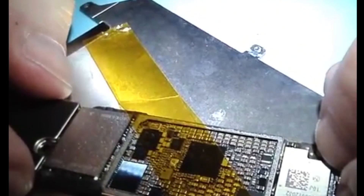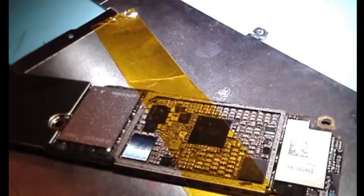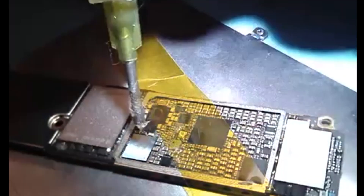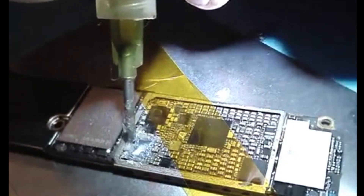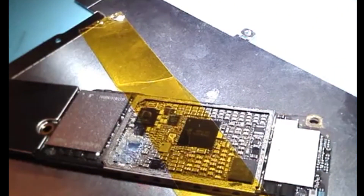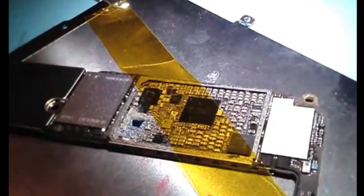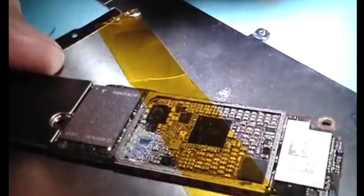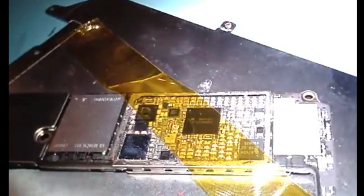So we're going to tape that down and then start on the repair. Now that this board is where we want it, we're going to crank up the hot air gun to 350 with a mild medium airflow. You want to come in and out on this board very quickly, because you don't want the Qualcomm or the cellular service to pop off the other side. So what I'm doing now is adding a little bit of flux to this audio IC. What this is going to do is protect that molten metal from oxygen and things in the air. We want this to remove itself as cleanly and efficiently as possible. And if that metal is stretching out and creating bridges, it's actually not going to come off as cleanly. What this is going to do is prevent that bridging, and it should bead up on either side as this audio IC is removed.